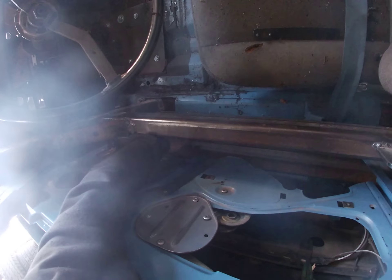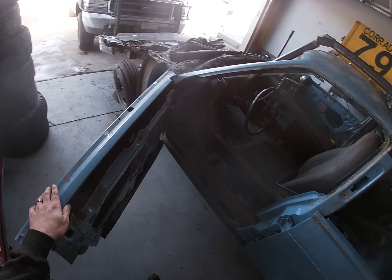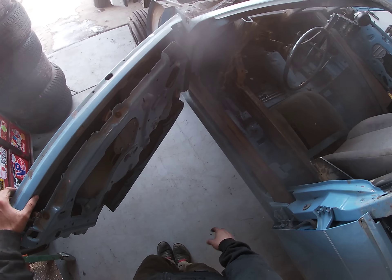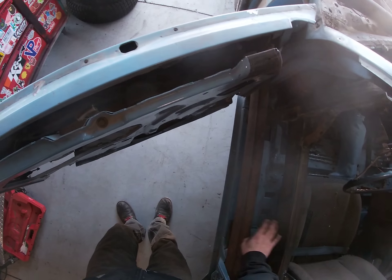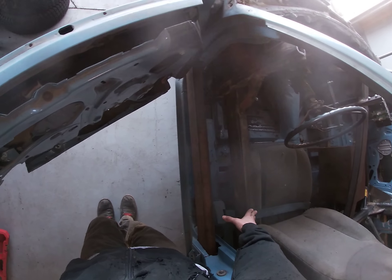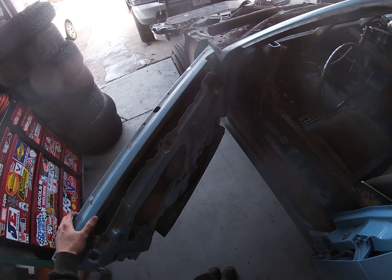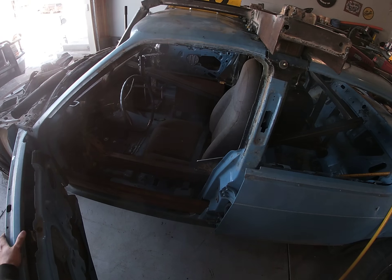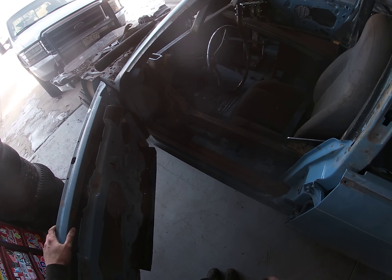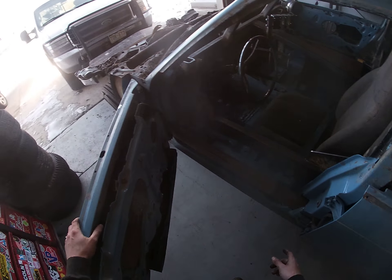Hopefully you can see that in there — there's my bar. That'll protect me from bumper hits coming at 24 inches. And then this is the cage proper, so I've got protection. I'm pretty happy with this. Above this, obviously the door itself — the outer skin — will be plated. So I'll get to welding this up and then we'll start cleaning up areas for door welds.